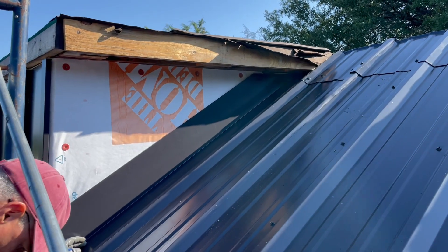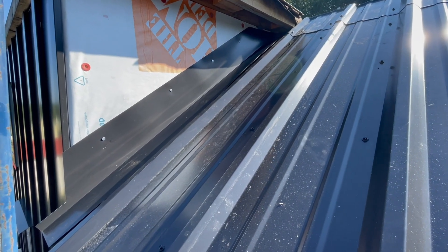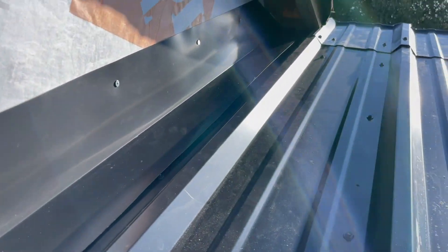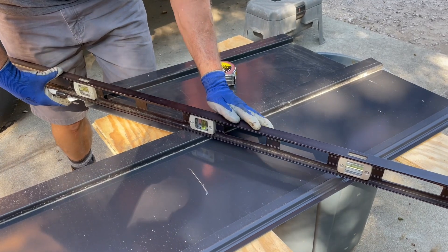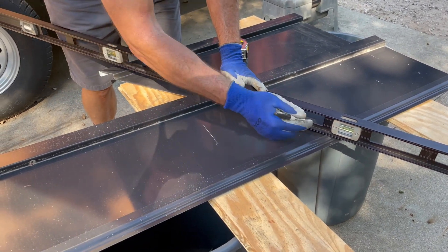Once we got to the edge, we were able to put on the rest of the siding for those two little triangle sections where the pitch changes and there's wall. Because of both roof pitches, there was no way to ensure we were putting those siding pieces level or straight, so we had to do the best we could. Doug's smart plan was to cut one piece to size and then pre-hook the next piece and just follow that angle — that worked well.